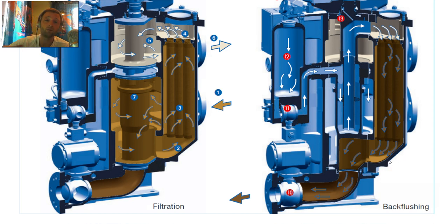After that, when you need to go to higher RPM, your cooling effect from the central coolers will not be enough to cool down the scavenging air cooler itself. The scavenging air will be really really hot. And if the scavenging air is hot, the exhaust gas temperature also goes up.